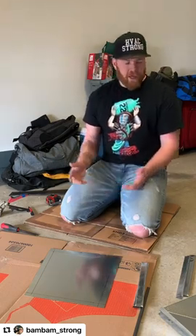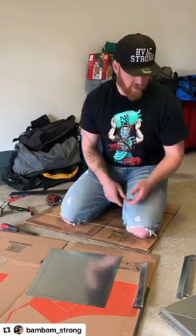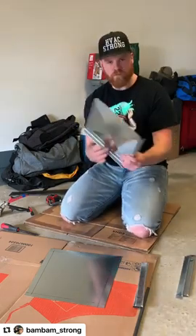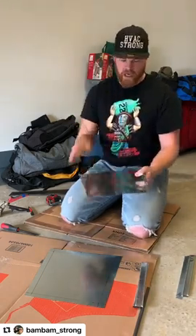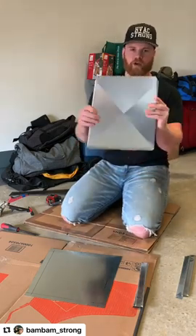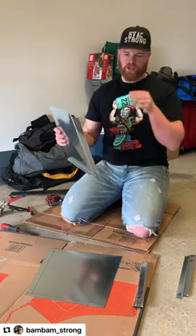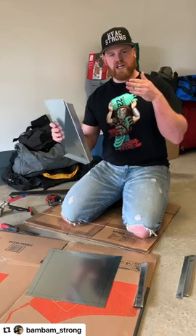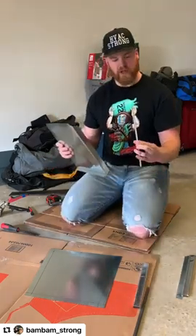When I make a four-piece, I tend to make two distinct pieces. The front and the back are usually similar, and the sides are similar. With the back pieces, I'll mark it all out, fold it, put the cross break, mark from the inside, and then I'm going to have a one-inch fold over on the corners. That's so at a later stage we can put on a piece of cleat and the side piece slots directly into that.